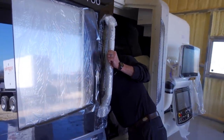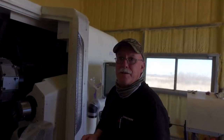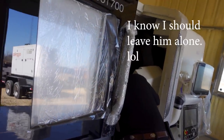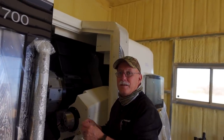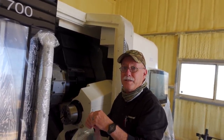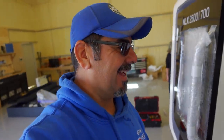I asked Mike how level he gets the machine. He said within four microns — measured with an indicator and a level. As for when it's out of tolerance, he says you'll know when you're cutting if it's not hitting the tolerances it should be. Hopefully it never comes to that. The machine sits on a two-foot-deep beam foundation, so it's pretty solid.